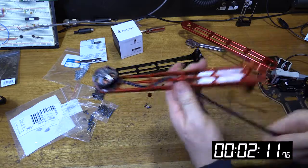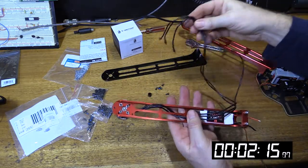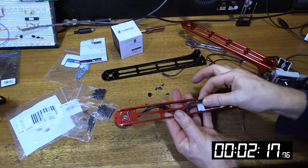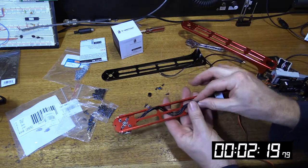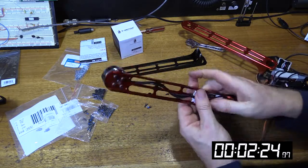I think that discrepancy is because manufacturers don't include the weights of the cables hanging off the items. The Tiger Motor motors had a spec of 80 grams, but with the motor leads coming out they were closer to 100 grams, so they were trimmed back a little bit — saved about 10 grams of motor, so the all-up weight of a motor is about 90 grams.